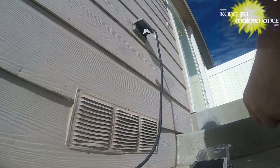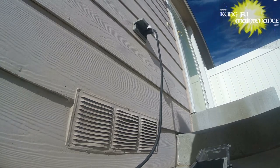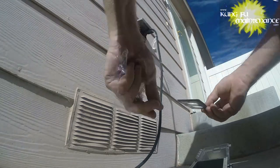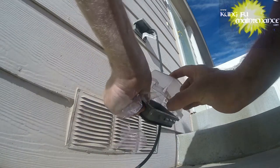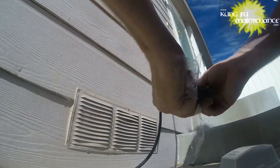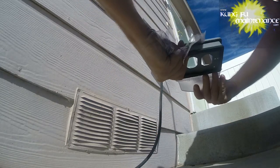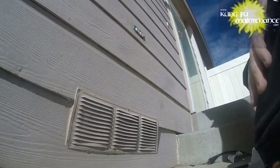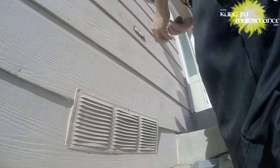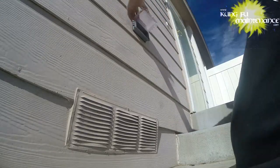It just depends on your configuration. Mine's going to be two duplex outlets and it's going to be sideways, so the plate is going to fit inside here. The swing can go any which way we want. I'll probably be going top-down, bringing my cord out through the bottom. The weatherproof gasket makes the seal all the way around — tighten it up and good to go.